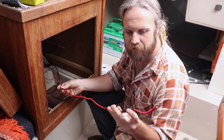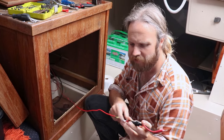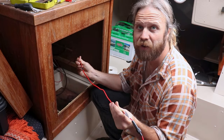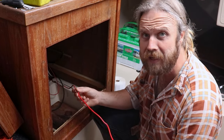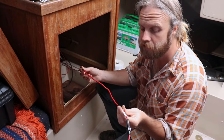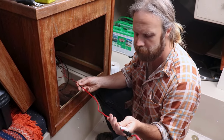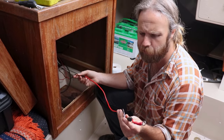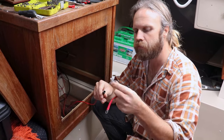You gotta love the way wiring comes out — you have a lighter gauge wire spliced onto a heavier section of wire, spliced back onto a lighter gauge of wire. Technically it works; there's nothing really wrong with it except you've got this big chunky piece of wire between two lighter gauges. But you are protected by the fuse, so only 20 amps should run through it.